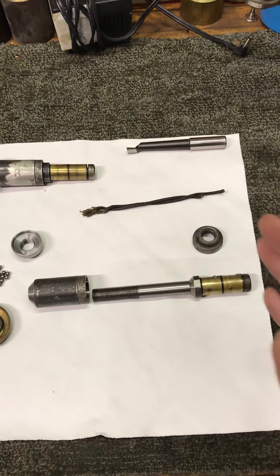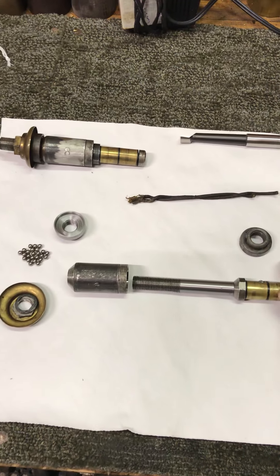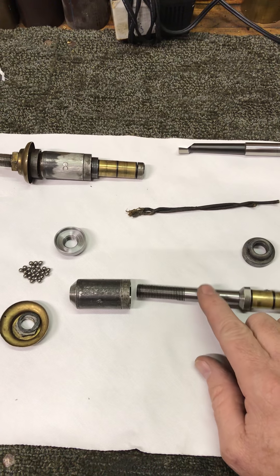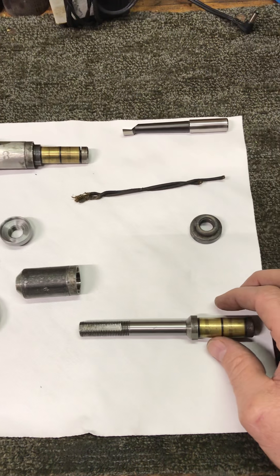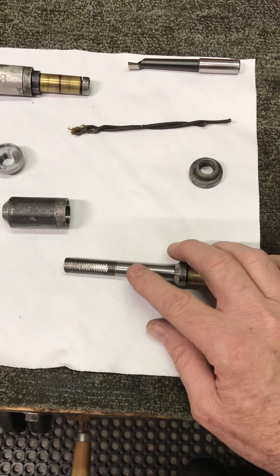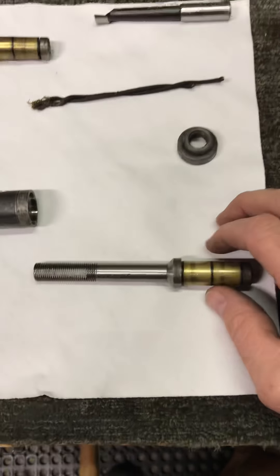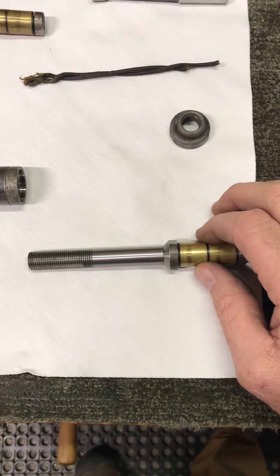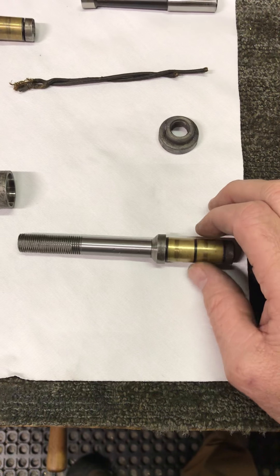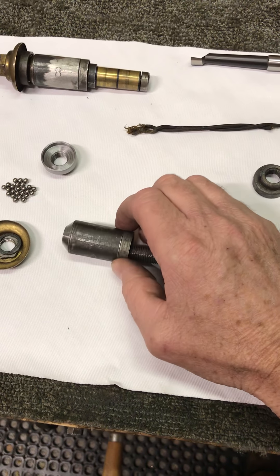With all that oscillating back and forth, it gets jarred and there's pressure on it. What happened is the shaft was bent, and sometimes I can straighten them out, sometimes I just have to make a new one. This one we were lucky — we put it in the lathe, put the dial indicator on it, and tapped around on it until I got it running within just a couple thousandths of an inch. Now we're ready to put this all back together.